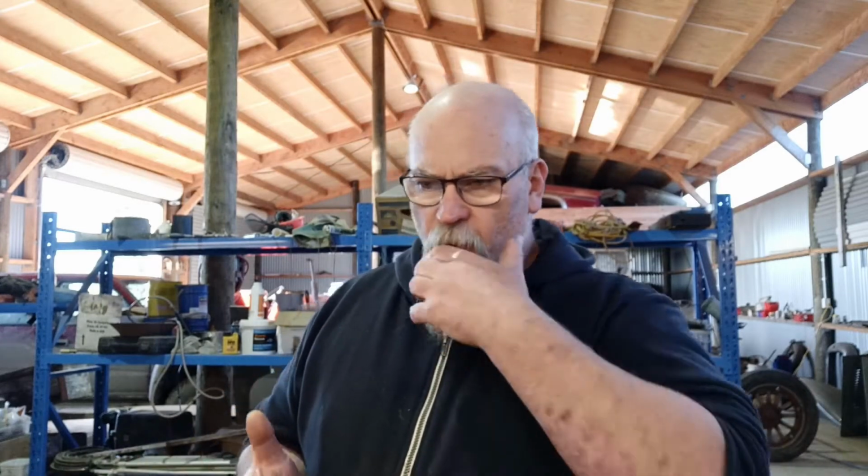And when I say body work, I mean cleaning it right down, etch it or epoxy it, whatever you want to call it. Every country seems to be a little bit different, and everybody does the little things differently. A lot of the time I've just put body filler onto bare metal. I've put etch or epoxy on, and then put body filler over top, and there are that many different ways to do it. You've just got to make sure, whatever you're doing, you do it properly and cleanly. Make sure you clean the body back properly, make sure the surface is clean, there's no rust on it, you've treated it for rust or whatever.